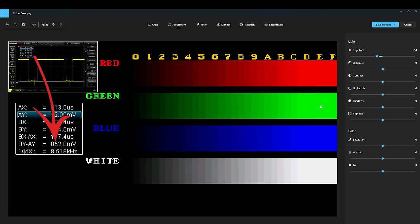The moment you start going over 714 millivolts, you lose detail. Even if you turn the brightness down on your display, the image was already washed out and you can't get that data back. Even though it's about the same percentage difference as the dim example, this too-bright example has so much of the image lost and it can't be recovered by just turning the brightness down. Analog displays are more tolerant than digital capture, but recalibrating a consumer CRT every time you switch back to original consoles would be a real hassle.